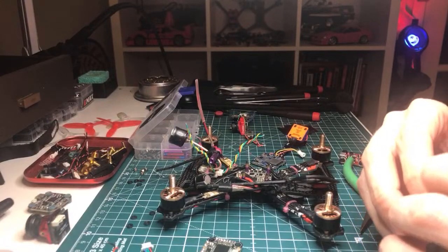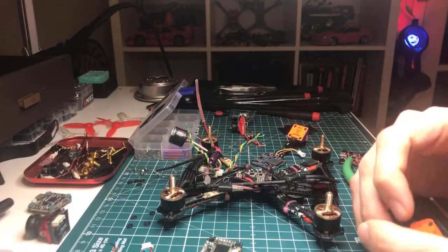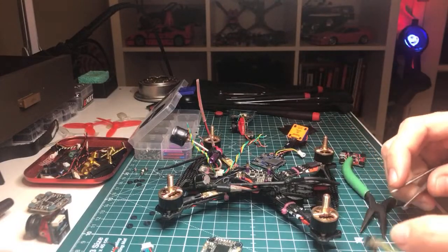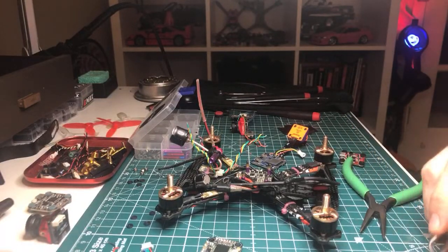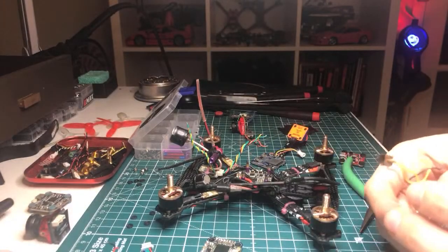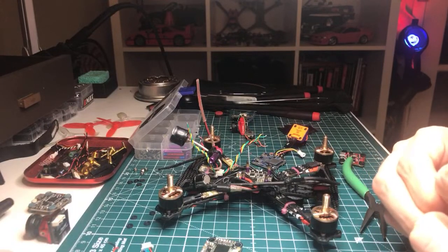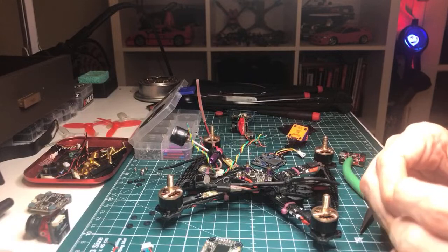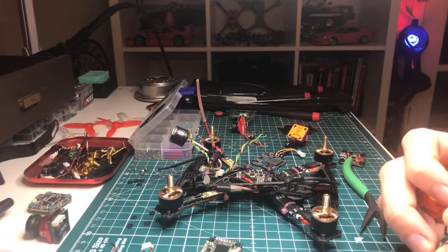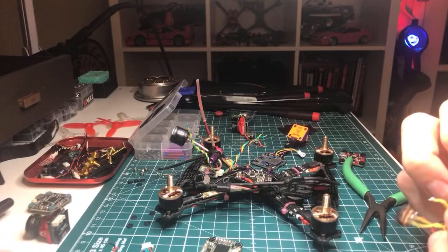Nice. Jason, yes, soft mounting the motors is something that I try to go back to as often as possible, because I very frequently see people singing its praises. I have yet to have it do anything positive, and I've had a couple times where it has caused negative issues. Basically, it's adding another frequency of vibration to the mix. It's going to make its own.